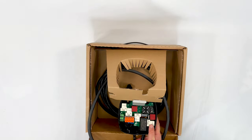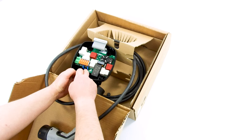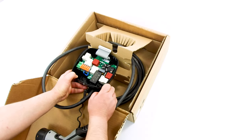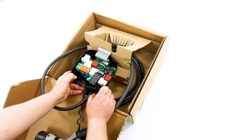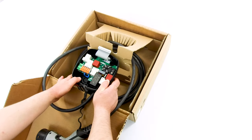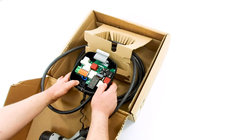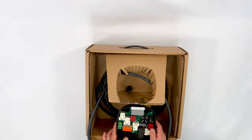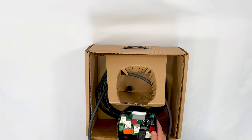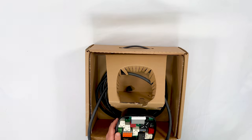It has built-in DC leakage protection. This is why you can't turn it into a three-phase unit — it's software locked. I asked them: if someone got three-phase in the future, could they remove the loop and convert it? They said yes, technically they could unlock it for three-phase, but unfortunately the cable supplied is only a single-phase cable. So although they could unlock it and you could put three-phase in, it wouldn't work. I'd like to have the option rather than being forced, and it would have been nice to be offered a three-phase cable as a future-proof option.